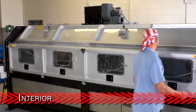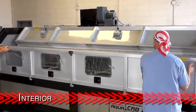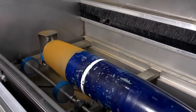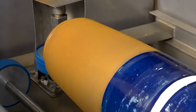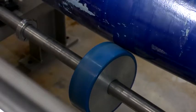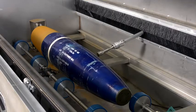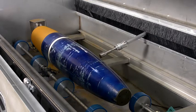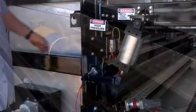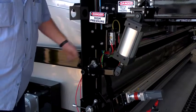The cabinet interior consists of all stainless steel walls, floor and roof. The outer edges of the wheels are made of high strength 60 durometer polyurethane. The wheels and shafts are gear and chain driven by a gear reduced motor on the far right end of the unit. The motor speed is controlled by an AC inverter, allowing the user to change rotation speed as needed. In the center of the lower cabinet is a sump area where all water and materials collect, housing a pump capable of passing small solids to the exterior. It is height adjustable to accommodate different diameters.